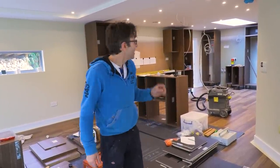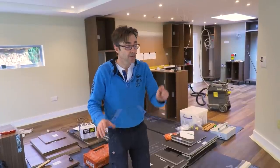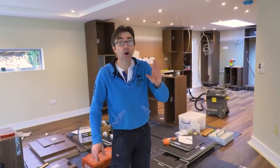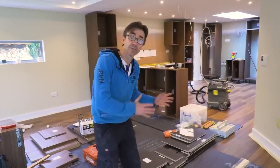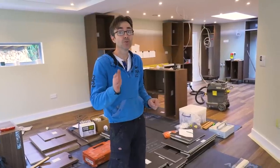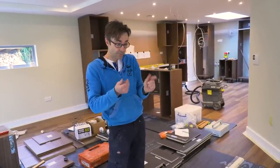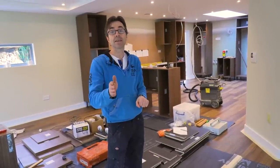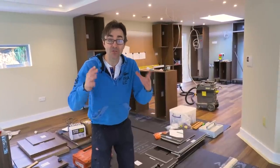I'm working off a finished floor. If you're fitting a kitchen and it's not from a finished floor — you might have ply to go on, tiles to go on — you need to accommodate that, or you will struggle. Especially if you've got a freestanding washing machine to put in underneath, because you need about 865mm for a washing machine with the legs tightened right down. So be very careful that the client or you know exactly what the floor covering is going to be.